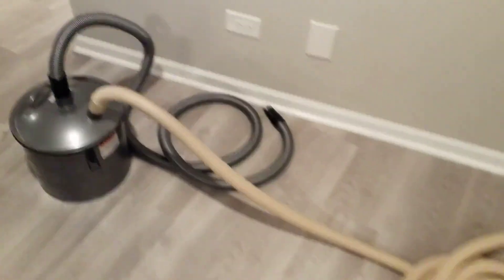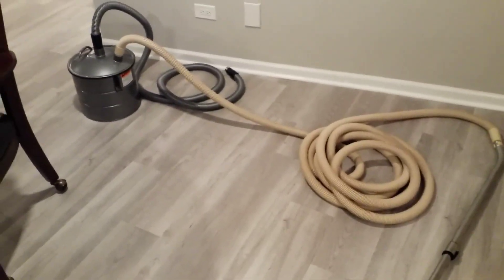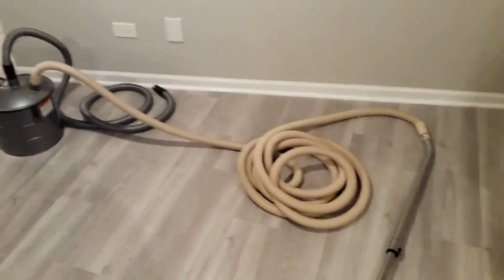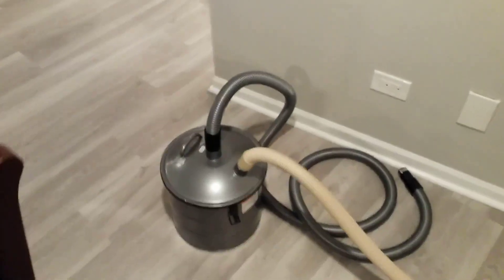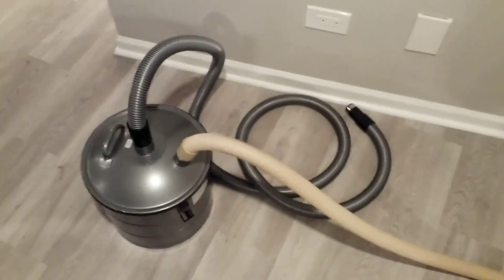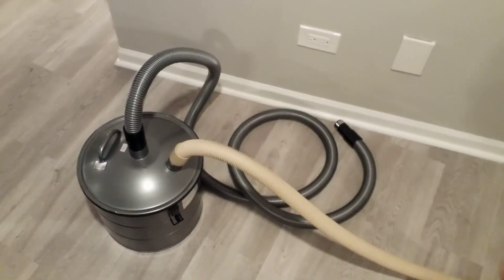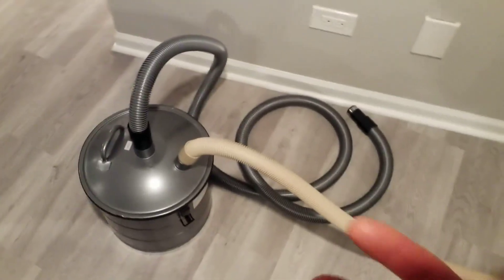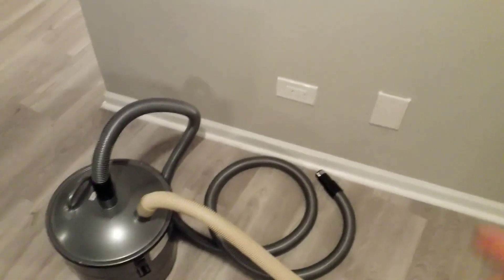You may have seen a setup like this if you've ever been at a pancake house late at night when they're vacuuming. Lots of them use a built-in vacuum for noise and health reasons, and also because they just last longer than a portable vacuum in a restaurant application. And they're actually using this to catch dry debris or semi-dry debris, because when you're sucking up food residue in addition to parking lot dirt and whatever else, that forms this greasy, nasty mass that builds up inside the walls of the piping.